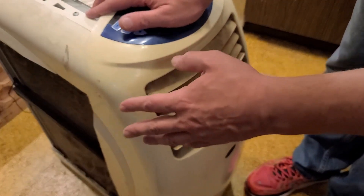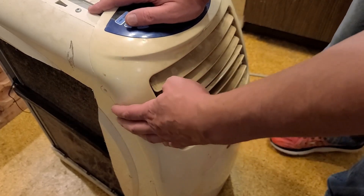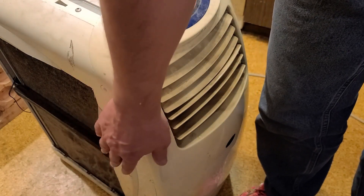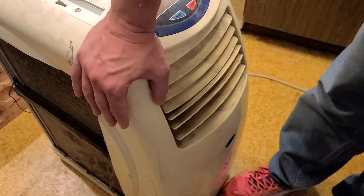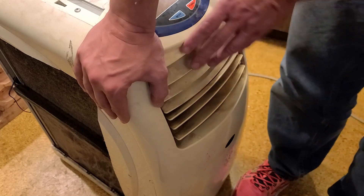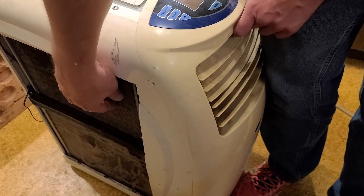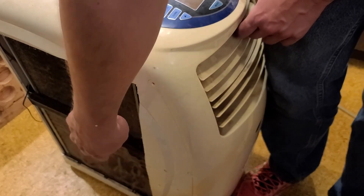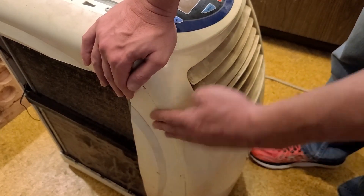Here's the front panel. Even though heat pump air conditioners are more tuned for air conditioning, there's more of a balance. What would be the condenser — the hot side — is still a little bigger than the cold side. The secret to heat pumps is a special valve that reverses both coils. What normally is the cool side for air conditioning your house reverses to become the condenser, so heat goes out here and this side actually gets cold.